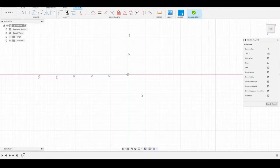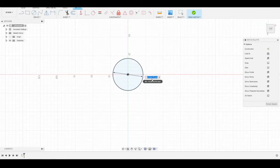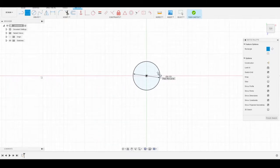There we go, everything on my desk now. We want to start off with just a plug for the arm, which I think we said was about 6.1 — let's say 6.5. I'm just measuring here. I think it goes out further the further we go, so let's just try and make it oversized and then slowly sand it back down. It's a round shape so we'll just go with a circle, and let's go with 6.5 — it's probably going to need adjustment anyway. So that's the plug.